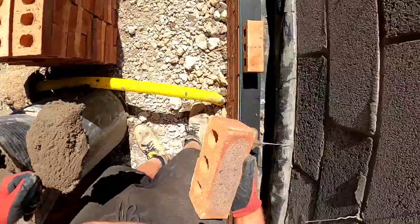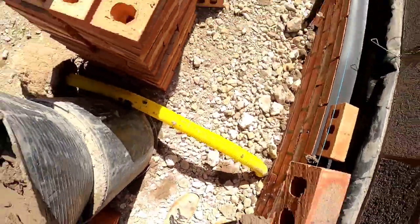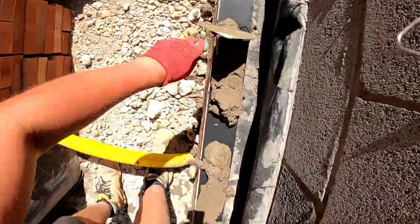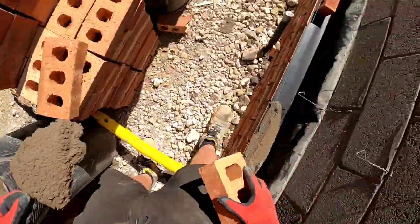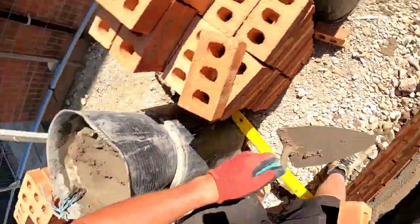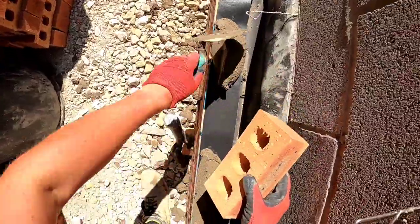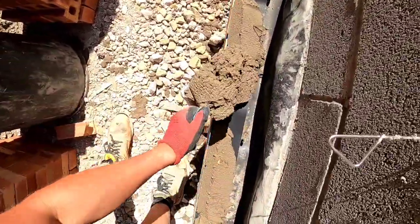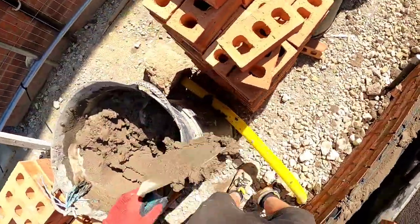Watch all my videos — the videos speak for themselves. At the end of the day, you're working out of tubs — laying in summer isn't a pain in the arse anymore, especially with the tubs. Keep your mortar nice and wet as you would on a board, just put it in a tub. Obviously using a bucket trowel — just in the name, I'm working out of a bucket, so I'm using a bucket trowel. I just adapted it to how I like to lay — put a bit of a peak on it, rounded edge, nice for cleaning the tubs. Away you go, it's not rocket science really.